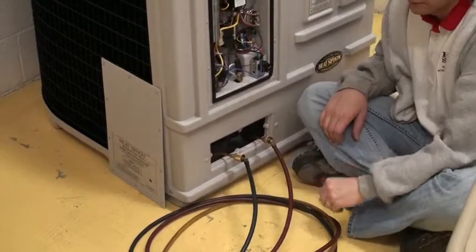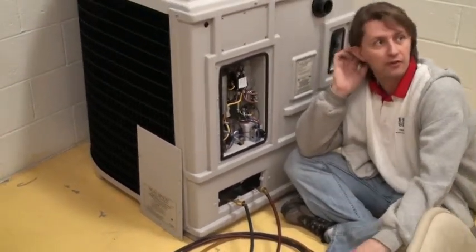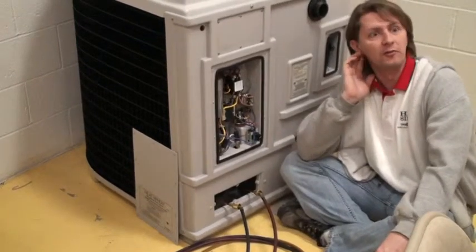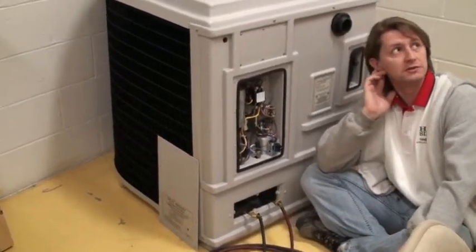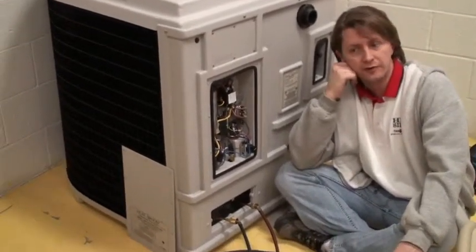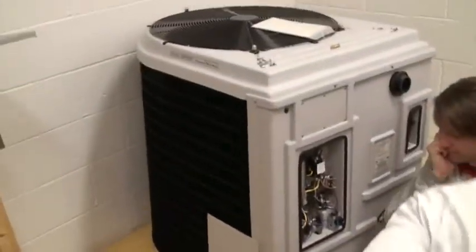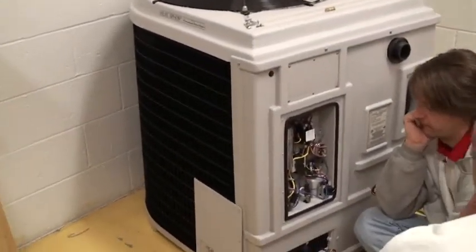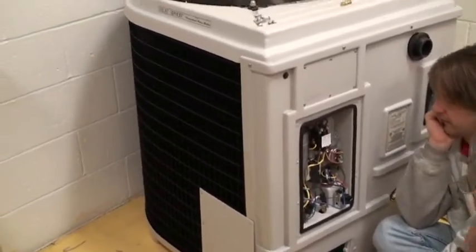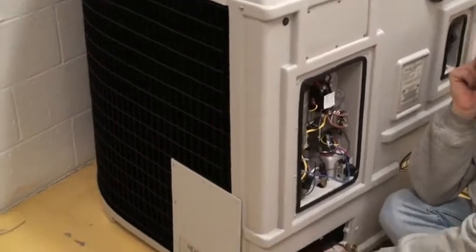When you put it in, a little bit of refrigerant comes out and it blows white. That little squirt is fine. The foam is probably either green or orange, depending on the dye. We've used a few different dye colors in the past. The little bit of refrigerant that you lose when you're putting that on is not an issue. So there's a plate, and all we need to do is pull that plate off and connect, right there.